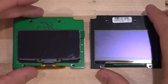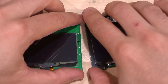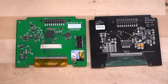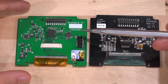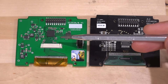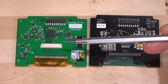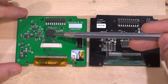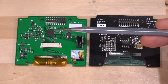The sequence of data to write to it will have to be completely changed. If I flip it over, it's a clear drop-in replacement — the connectors are in the same places, the screws in the same place. But we need to retranslate the pattern coming from the multimeter before it's written to the OLED controller. You could put a microcontroller in here, read everything, and retransmit it after interpreting the data, but the problem would most likely be latency — you'd have to wait for packets to complete before retransmitting.